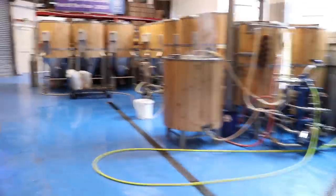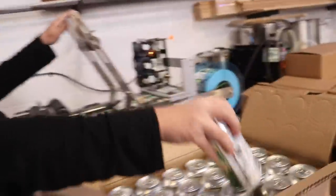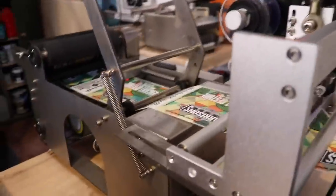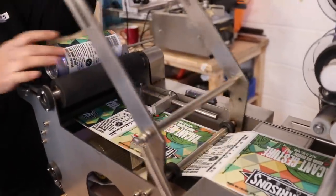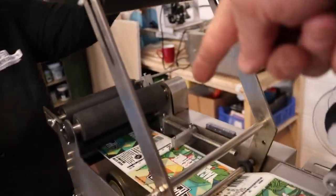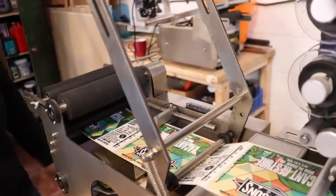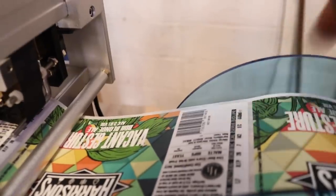I also want to show you the labelling machine — Gem's labelling at the minute. We'll just have a look at how it's going. I had to iron a few creases out this morning; I had to reset the light sensor, which is the little thing down there. It kind of stops the paper advancing forwards when it hits a gap between the two sheets, because the light goes through the backing paper.